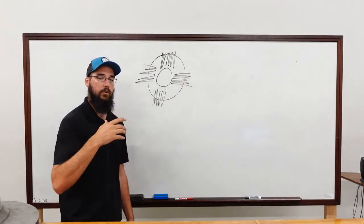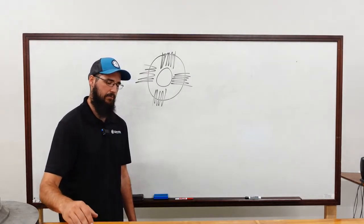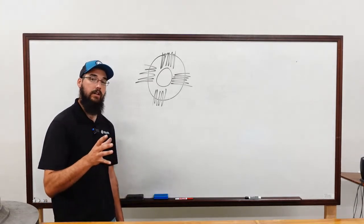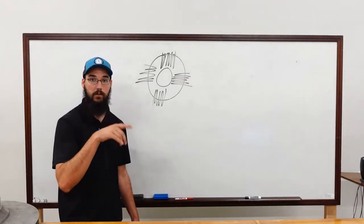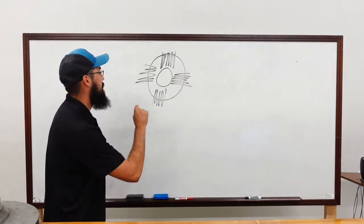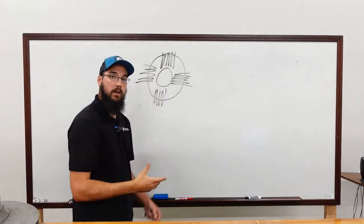And a smaller version York has, or what am I saying? York's version of this, the YMC squared series, uses mag bearing. It's mag bearing tech. And those PRVs don't even rotate. They're in a fixed position at a 100-something degree angle. All they are is pre-rotation. They don't have any kind of load control. All that's done through a VFD to speed the motor up and down. But it's got a mag bearing assembly inside of there, and you have a PWM module.